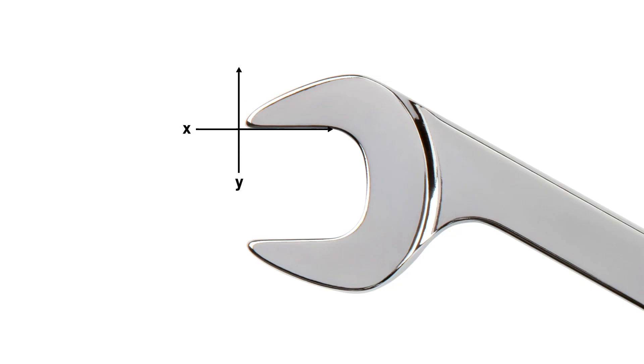The jaws are mathematically engineered to be as lean as possible without compromising any strength. We've designed the inside corners to have the largest radii possible, because that is the area that takes the most stress.